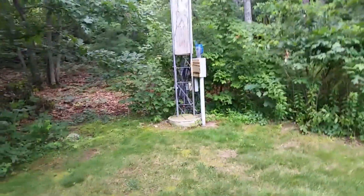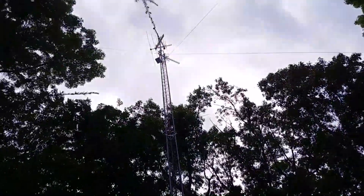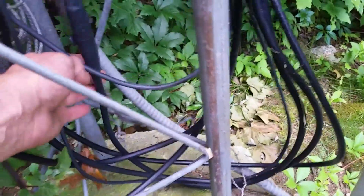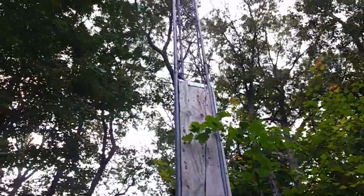I'd like to give people ideas on what they should think about. The first item is lightning protection, and technically I don't have any — although you could say I have a little more than nothing. When you build a tower you have to ground it. This tower is grounded — here's one ground rod or ground wire, and there's a second one on the back — but these are done with acorn nuts, bolted on the tower starting from the top.